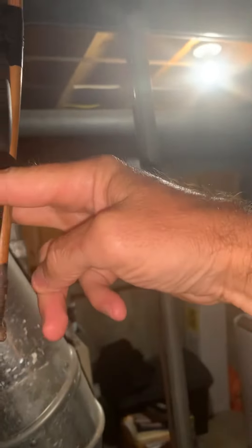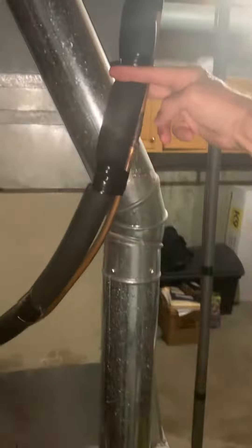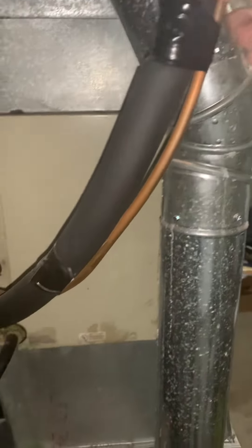After the coil, we want to redo the sheet metal plenum to the top. The line set — we've got a solder joint here. Maybe we make our cut right in here, flush, solder back together, and get new insulation on that. And then our condensate drain — we could probably come out over on this side with the new coil, right down into the floor drain.